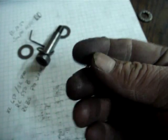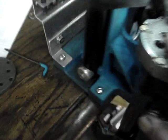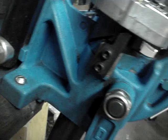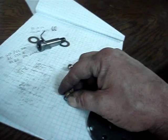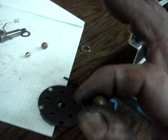It's just right. We're heading for the verge of not working at all. We want to minimize all the impact, shock, and vibration to get rid of the powder spills, which ruin our day. And in doing that, you might have to fool around with this a little bit. You can loosen those screws on this other cam follower. Yes, there's cams all over the place. And adjust that so that the handoff is just right, because we're dealing with the lowest pressure possible. If we had a higher pressure and a bigger spring, we could pull further, but since we're going for the bottom of the barrel, we want to index that over as close to zero as possible, and let that just take up the last teeny weeny bit. It works great. It makes life better.